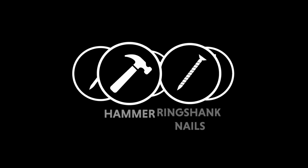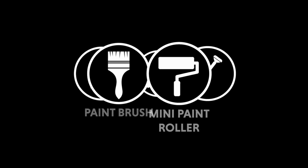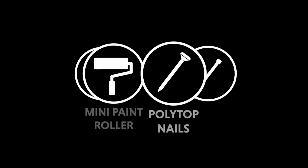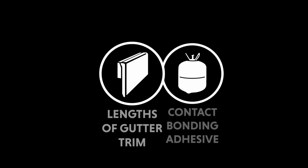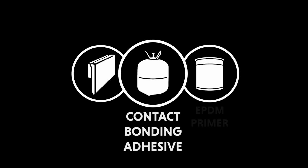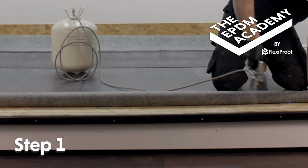Tools required: hammer, Ringshank nails, paintbrush, mini paint roller, PolyTop nails, fixing pins. Materials required: lengths of gutter trim, contact bonding adhesive, EPDM primer. Installing gutter trim with Fleece Backed EPDM involves a slightly different approach compared to using one-piece EPDM.